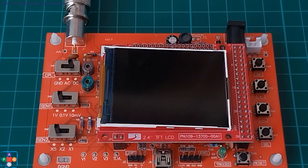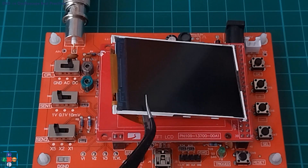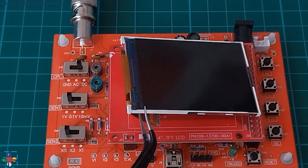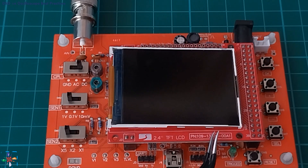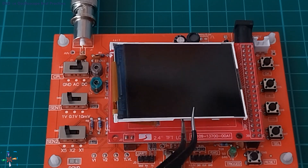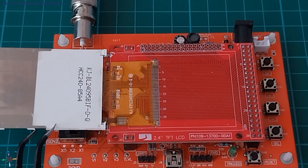One of the biggest design flaws, in our opinion, is the LCD display. The display itself, on the left side, is very loosely connected to the board via a thin ribbon cable, and on the right side is glued to the board. In time, due to heat, this glue gives up and leaves the display to flap around the board at any movement. Inevitably, this leads to the ribbon cable breaking, or breaking one or more contacts.